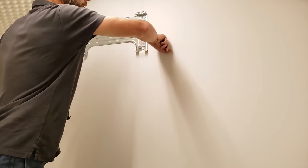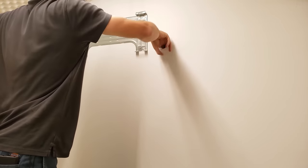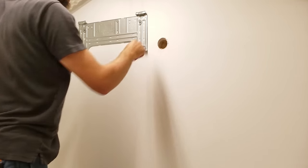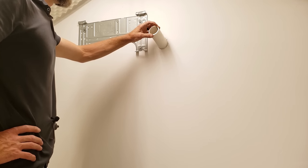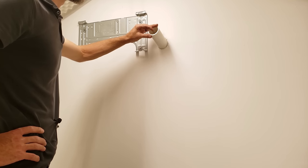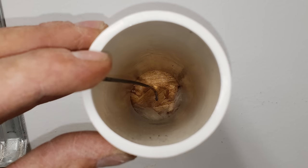I'm going to pull this out and cut this last little bit, and I'll move this insulation. I don't notice any electrical wires, so we're good. I temporarily put the PVC in the wall — this is a two-inch piece of PVC on the angle in which we want to run the line set, condensate, and electrical line. You can see on the inside where we have our probe to the outside — it's right in the middle of this PVC, and that's perfect. So I'm going to go outside and drill the hole from the outside inwards now.